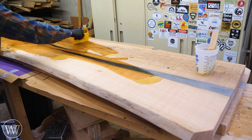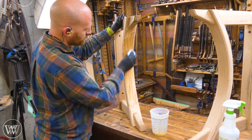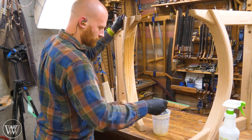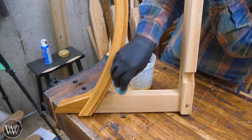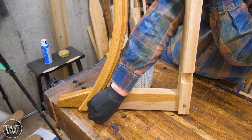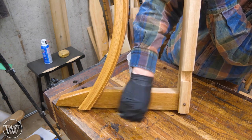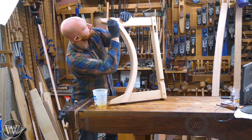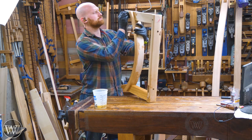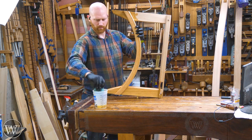But the nice thing is you can just smear it onto the wood, slide it around, and then let it sit for 10 to 15 minutes or so until it's fully soaked in. It really doesn't take that long, and then you can grab a rag and wipe it off. You wipe it off and basically polish the surface down, and you're left with this really nice, clean, smooth surface that feels good, looks good, and is protective, but still matte, and you can still see all of the grain structure in the wood. It's kind of the best of both worlds.